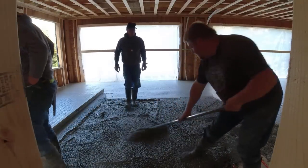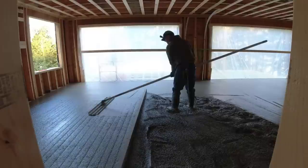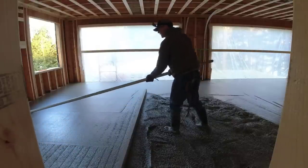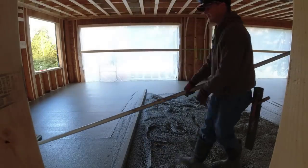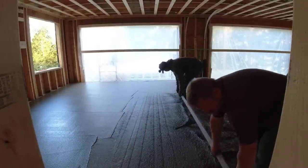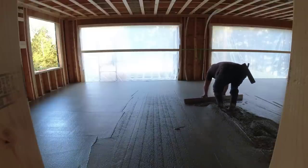We're making sure we're screeding nice and slow, getting the area nice and flat. When it comes time to bull float, the interior walls make it a little more difficult so you can't really go wall to wall before you get the thing bull floated. You can see how nice and smooth the bull float leaves it, and then from there once it gets bull floated we'll let it set up, then jump in on some knee boards later on and get it smoothed out by hand.